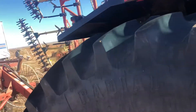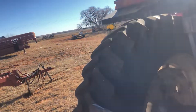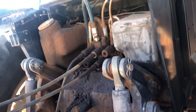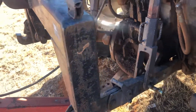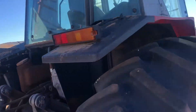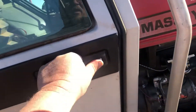It's got one real good tire on it, almost new; the other one's good but not new. It's got the thousand PTO in it right now. Just came from the field so it's a little dirty. This three-point does not come with it, but I do have the original three-point that goes with this tractor — it's a category two. Of course you've got the dual, and it's got the double door.